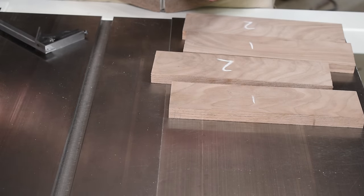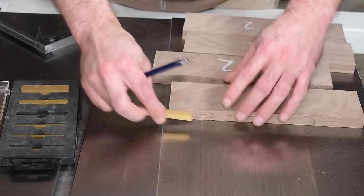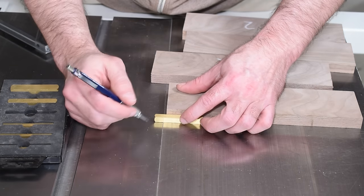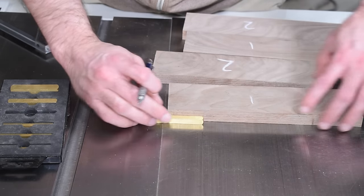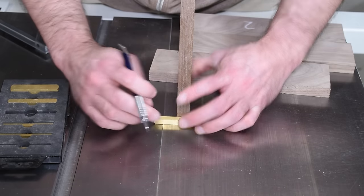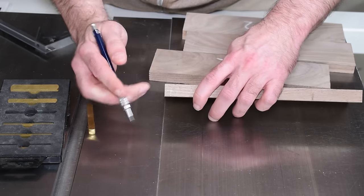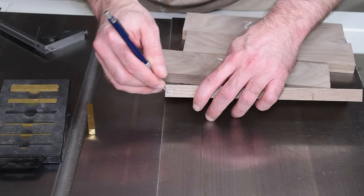Now I have some of these brass setup blocks and they are super convenient. They're really not that expensive. So I'll put a link in the description if you want to pick some up, but I can mark it, turn the board up and mark it again. And then I know I have a perfect square and I need to cut out the waste right here.